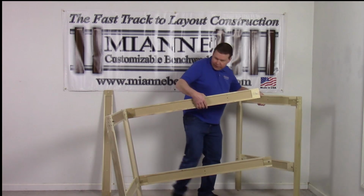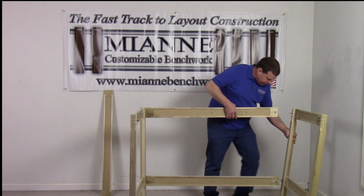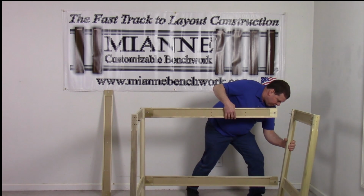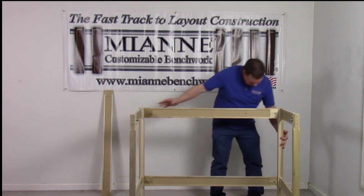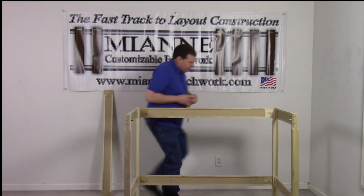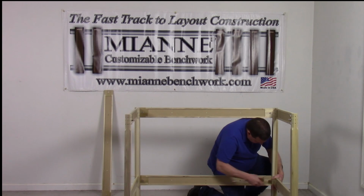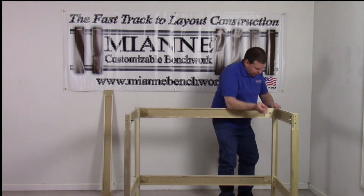Take your additional 2-foot section. You're going to line up the I-beam with the leg. Slide those together. You'll get your number 3 Phillips screwdriver. Again, making sure that your arrow is pointing to the end of the I-beam so you can lock this properly. Tighten that up. Same with the top.